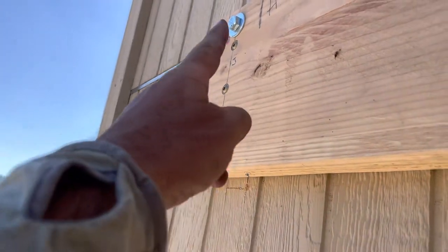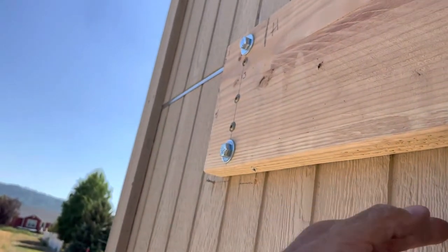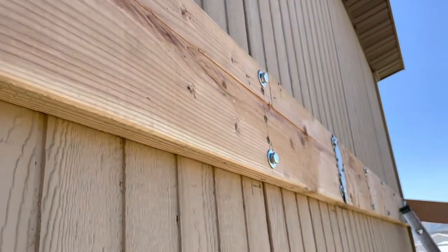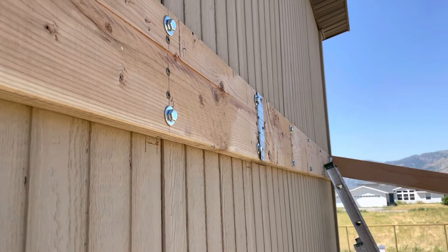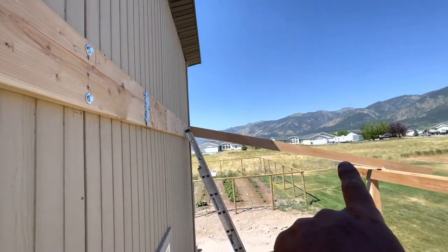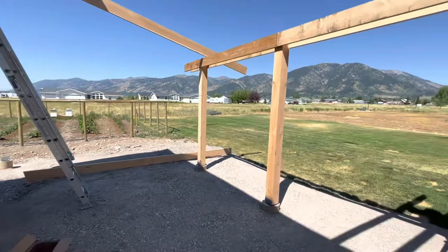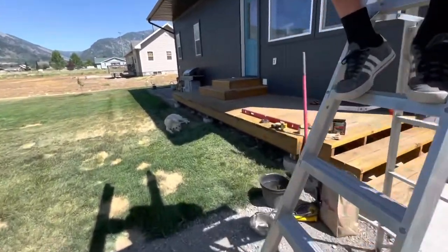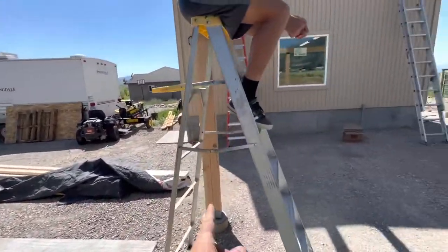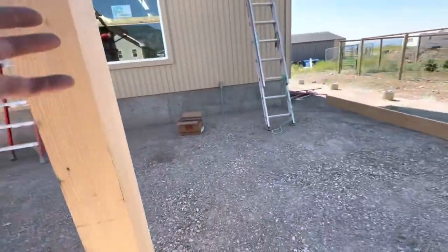We finished setting the bolts. We drilled into the wall with a three-eighths inch drill bit so the half-inch bolts would have something to grab hold of, and we did 20 of those all the way across. I put a plate on the seam. Then we stood the posts up first into place and used a post level - it gives you level in both directions. Got them pretty close and threw four simple three-inch screws in the bases on each side just to keep them in place.